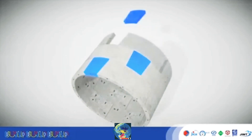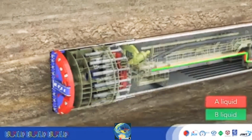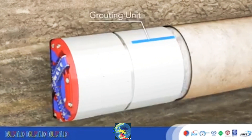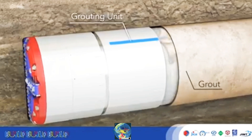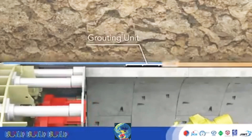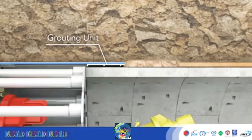The TBM uses a symmetric staggered joint construction. The embedded pumps in the backup cars pump A-liquid and B-liquid to the grouting units mounted in the machine. Two grouting units pour grout between the segments and the skin plates, while the TBM performs excavation. This prevents subsidence and water leakage from between segments, as well as rapidly stabilizing segments.